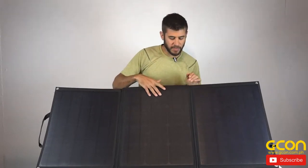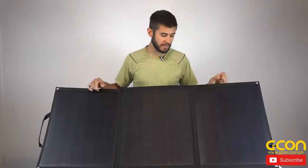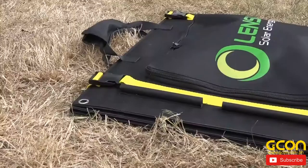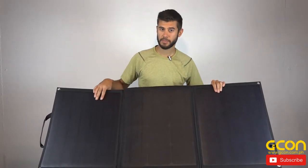I think they're very comparable to other solar suitcase models in their power, but their size, weight and flexibility is so much better. The only concerns I have with a laminated system like this is I just don't think that laminated panels are going to last 25 years like a nice glass panel will. But this system isn't going to be out in the elements constantly — and it shouldn't even be out in the rain because that PWM charge controller on the back is definitely not waterproof. Overall I think the panels are quite well built. Lensun is a pretty well-known manufacturer, especially in the marine community where they use flexible solar panels to conform to the shape of a boat. Lensun is a Chinese manufacturer and I didn't get any instructions with the system — it came in a nice box but there were no instructions. They do have a pretty good website with a lot of specs and more information, so check that out if you're interested.